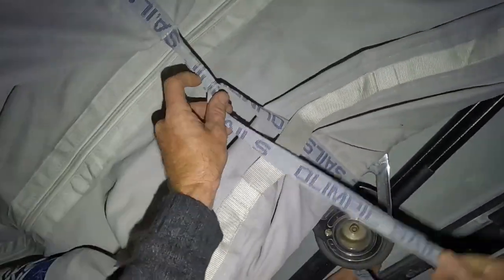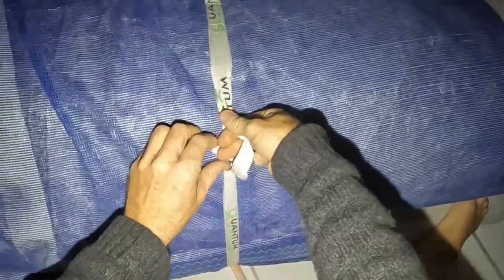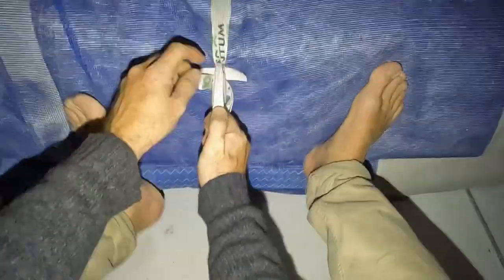Great way to blow your back out, all this stuff. Do make sure you've got some experience of lifting and shifting — people say bend your knees when you're working with heavy loads, but the other piece of advice is get used to lifting heavy stuff. There we go, it's going into one of the other sail bags, all done up nice. There are ties on the bag that then secure it in — never too tight with these, just kind of a loose roll — and then we get the sail tie on at the end. Pull it tight, tuck it in behind first, then pull it tight.